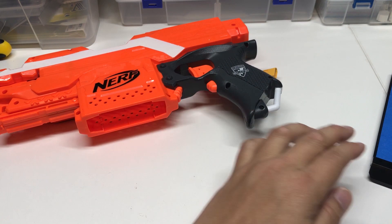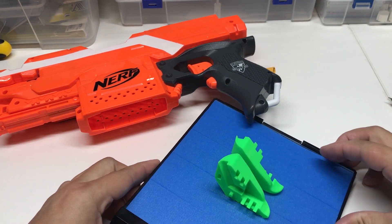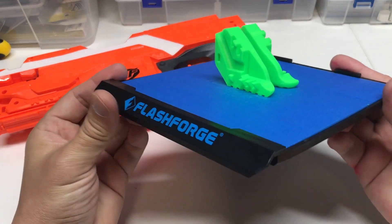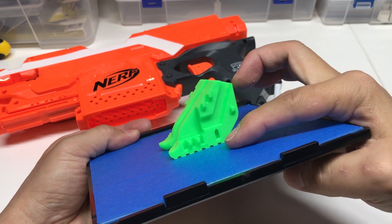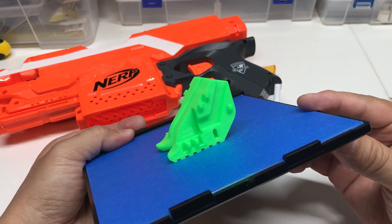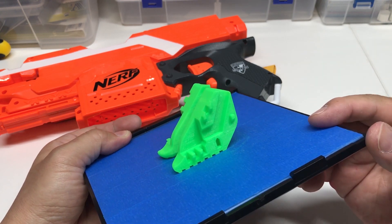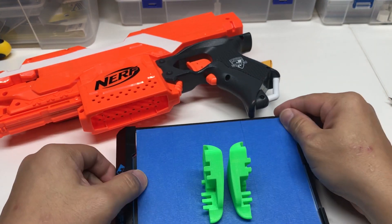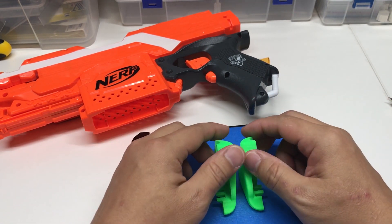Let's take a look at this one I just printed out. The way I print it is in this orientation — it's upright. You do not need any support even for this part with the pattern over here, as the gap itself is very, very short. The printer should be able to handle it, so you can print it in this orientation without support at all for both patterns.